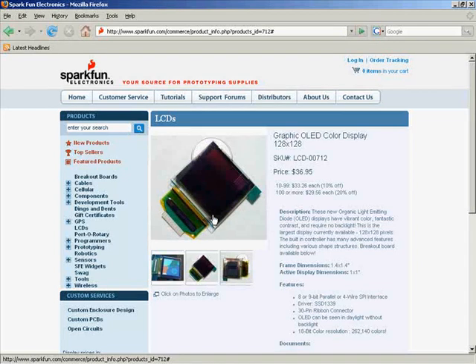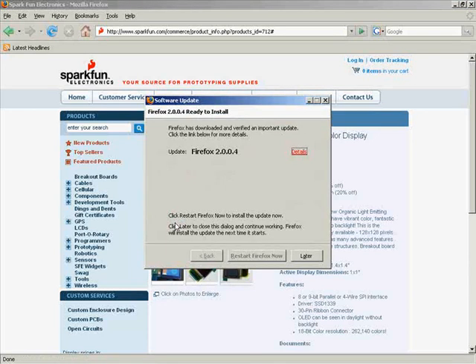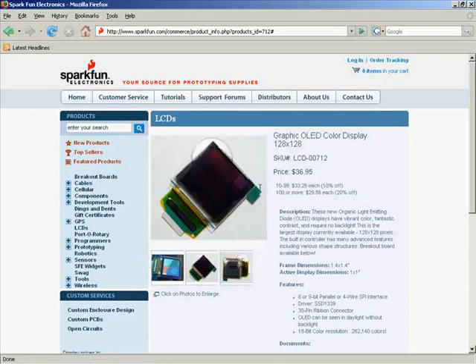The display can stick in front of the board a little bit — we're talking a couple tenths of an inch — but you have to make sure you have enough clearance to slide the connector into the socket. You'll most likely have this cable coming in on top of your board rather than from the outside edge. This is a ribbon cable — it lays very flat — so you slide it into the connector from the PCB into the connector.